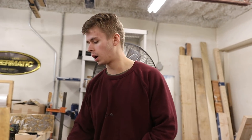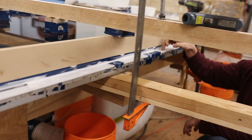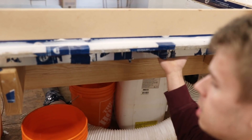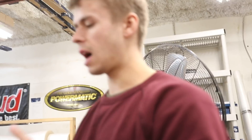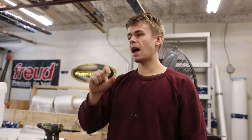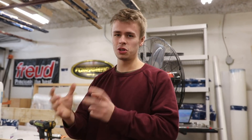The final thing we do to really make it all work is we have an aluminum mold. Underneath this plastic sheet there's a sheet of aluminum, and we have an air conditioner right underneath blowing cold air on the bottom to dissipate all the heat. By doing those three things — the cooled aluminum mold, the air-conditioned room, and the fans — we can take a product that's only rated for two inches and pour it all the way to six inches. Cooling is super important, I cannot stress that enough.